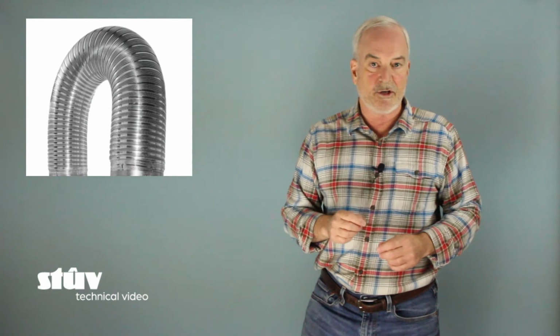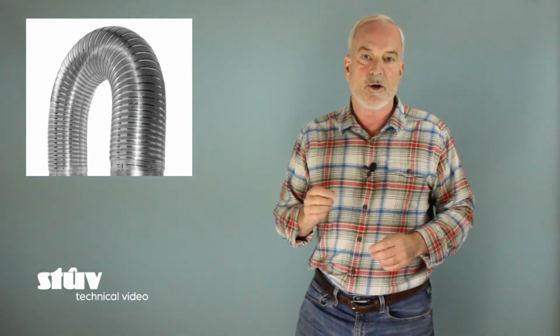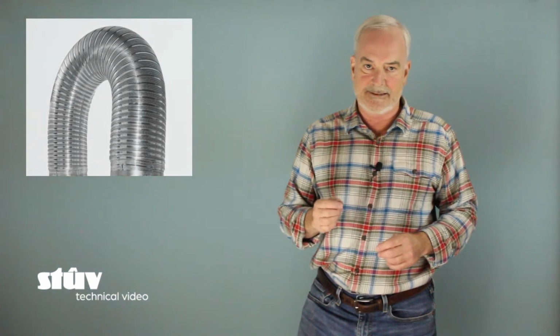In colder climate areas, shaping a loop in the conduit run or installing a gooseneck at the outside wall will help reduce cold air circulation inside the system when the fireplace is not in use and prevent possible condensation due to temperature differences. Now that you've run the conduit to the fireplace, you'll need to hook it up with the use of an airtight box.